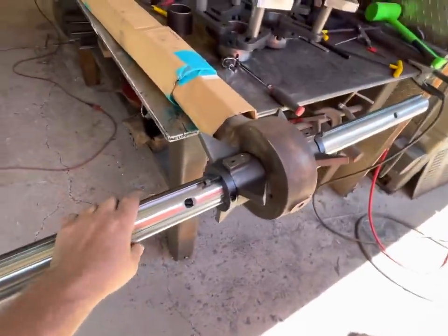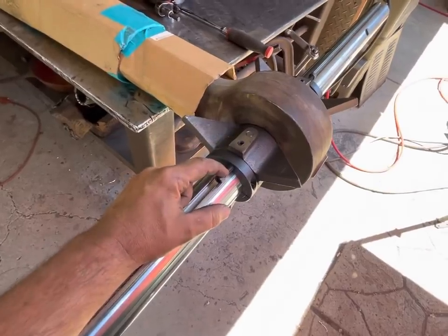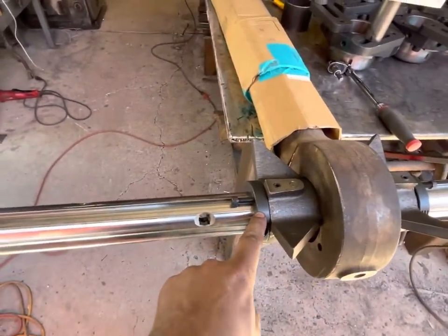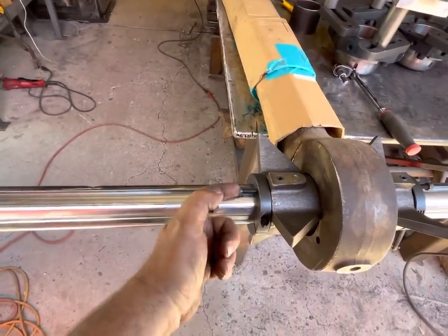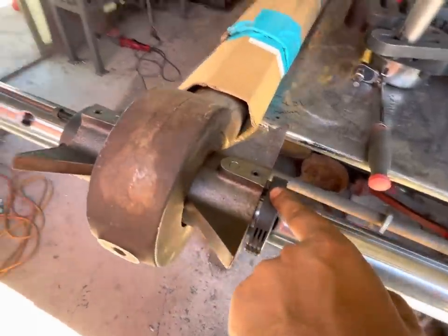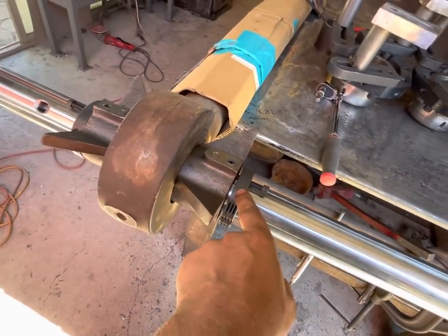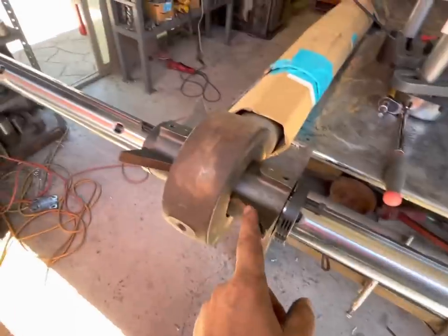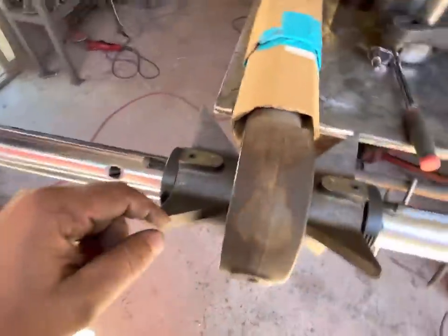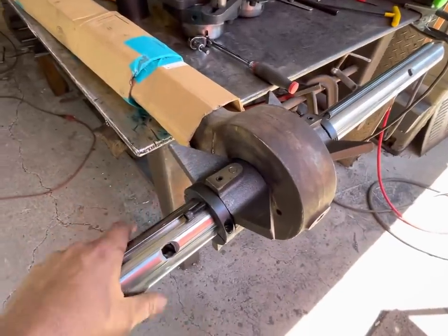So we've got our bar, we've got our centering cones, we've got our locking rings with these screws, and you basically just put it all on there, you tighten these rings, and you tighten the screw, and it will push. So you can see that the ring stays in place, and it pushes against this alignment cone, and then it helps to get the bar really, really close.